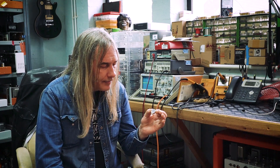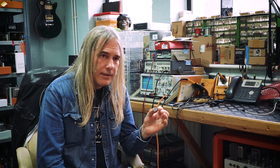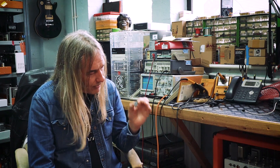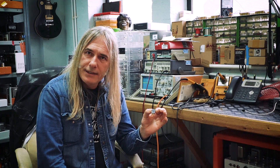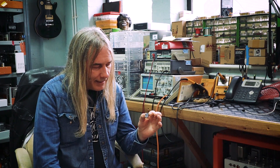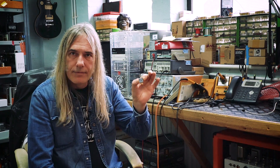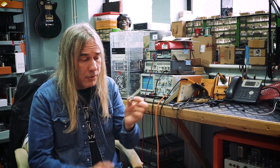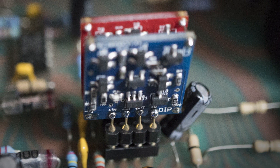It can be used as buffers, can be used for gain — pretty much anywhere you'd plug a TL072 or NE5532 in a piece of gear: balanced output stages, gain stages, etc. It plugs in instead of the dual DIP IC. It comes with a socket as well, so you can solder the socket in, have it removable, and still A-B it against the IC you took out.